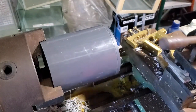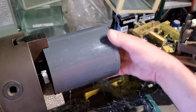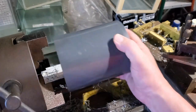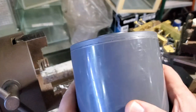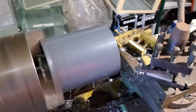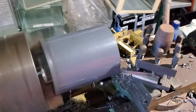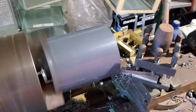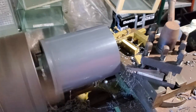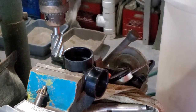I just wanted to clean that up, and the other thing is to keep my hand in it. I don't machine tons of plastic, especially PVC, so when I get this opportunity I want to keep those skills at least reasonably used. You can see even running it through the lathe, there's always just a little bit of glue buildup you just can't get rid of. So I've cleaned up the back end and now I'm just going to chamfer the top end. I cut myself way more often on plastic when it has a sharp edge — just running your finger along it and getting a little paper cut — so I always like to remove that.